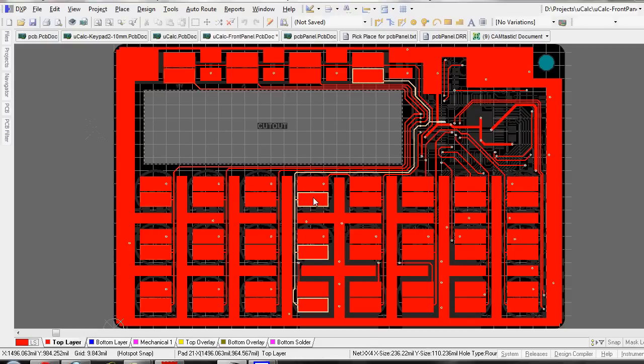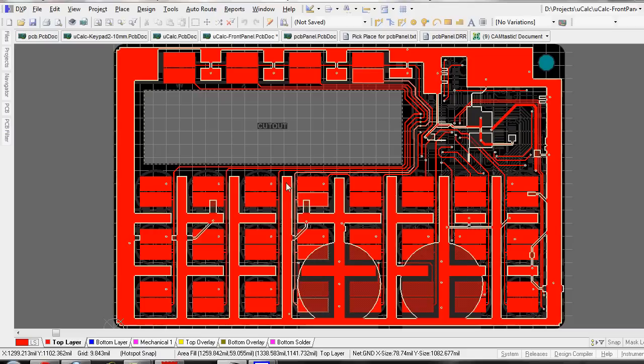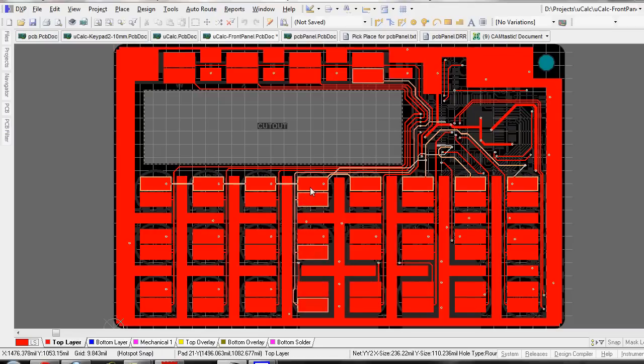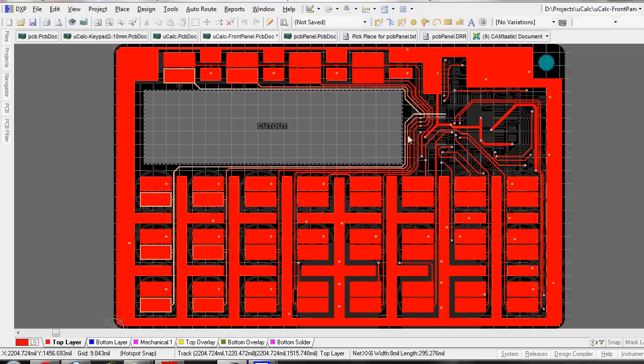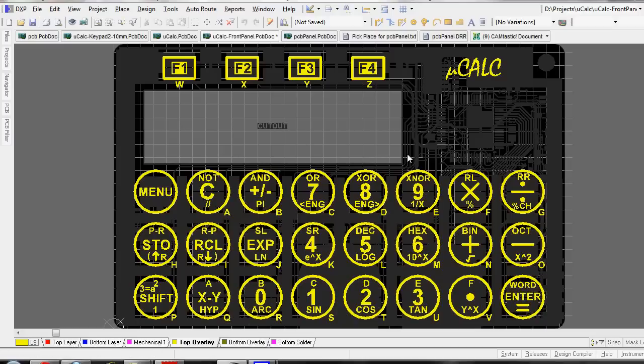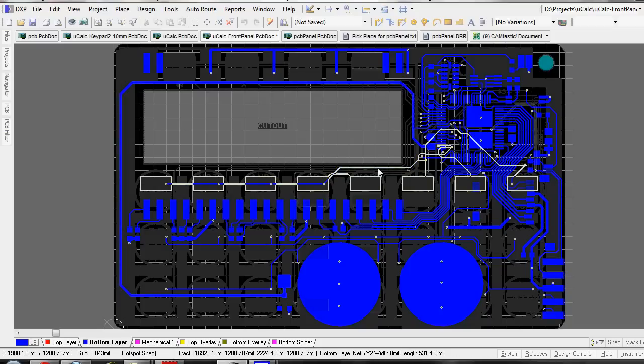These are capacitive touch buttons — they rely on the finger changing the capacitance between the pads, which can be detected by the microcontroller. There's a whole art in designing these buttons and a whole bunch of app notes on how to get it right. As you can see, there's ground in between the individual buttons, and there's a bit of trial and error in determining what size pads to use for different finger widths and button spacings. You often won't get these capacitive buttons right the first time. Signal traces need to avoid grounds and other objects, which is why you wouldn't flood fill these boards with ground. I didn't flood fill anything on the bottom layer.